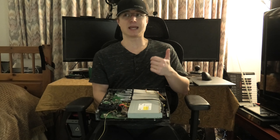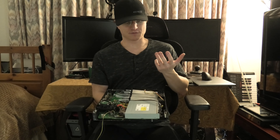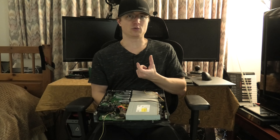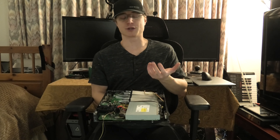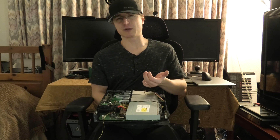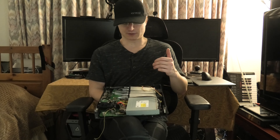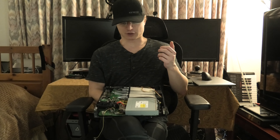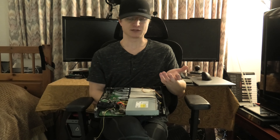There's a fan header here but it can't quite provide enough current for running the fans. So I've ordered a piece that will allow me to use a voltage up-conversion to run the fans, which also gives me a little more current to play with. I should be able to run the fans at full tilt if I choose.